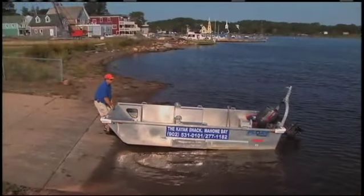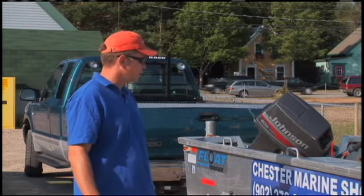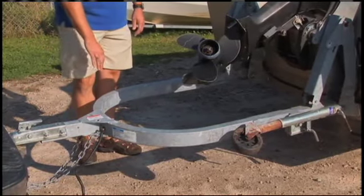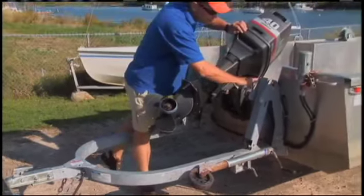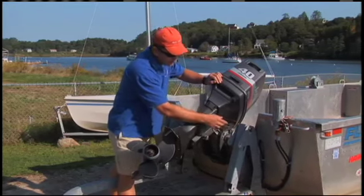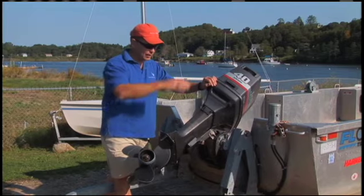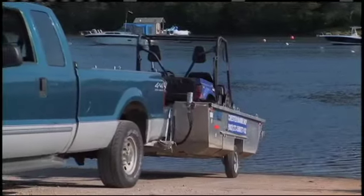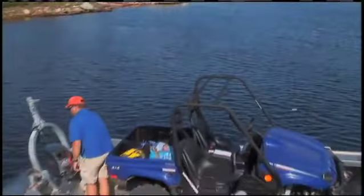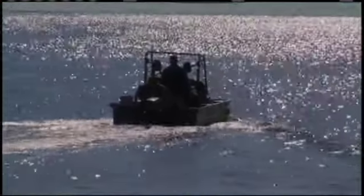Behind it right now we have a commercial 40 horsepower motor. They're rated up to 35-40 horsepower for the small version and up to 90 horsepower for the bigger 20-foot version — you could put bigger behind it but they don't encourage that. In front is the tongue in trailer configuration. It has two security pins to make sure the tongue doesn't come up, and these pins can be taken out by hand. Once you unhook the trailer in the water, take out the pins and release the hydraulic pressure, the whole tongue comes up and becomes practically a safety bar over the engine. This float trailer may be just the perfect solution for towing on the highway and navigating the waters, all in one.